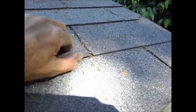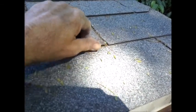So I have the ladder set up in the front of the house, and you see there's a hole here they've cut out for some reason on the side of the house, and that needs to be patched. And there's wood trim that needs to be repainted, peeling paint. And this little section here is the only gutter you have, and it's deteriorated and rusted out. And the type of roof you have here is a composition shingle, and it's pretty rigid, so as it gets older it gets more rigid.